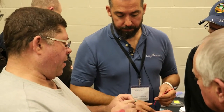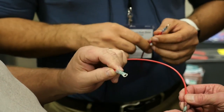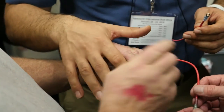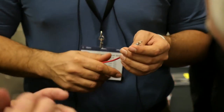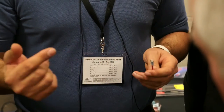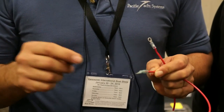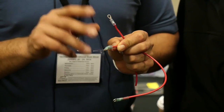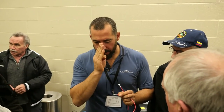The heat shrink terminal comes pre-loaded and the heat shrink closes in when you apply heat. The critical technique: don't crimp on the insulation — with these ratcheting crimpers there's a double crimp, one on the wire and a lighter one on the insulation. You always have to see the jacket and barely see the metal where the wire starts. If you don't see it, the jacket is underneath, and when you crimp down, part of that terminal won't be able to touch the wire.